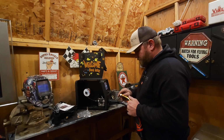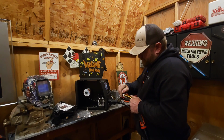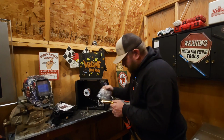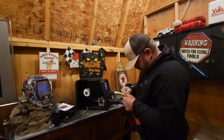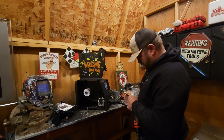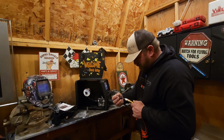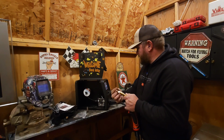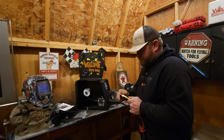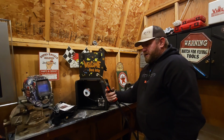Figure out which wrench it is. One thing I have to say, I'm gonna say it didn't look like the wrenches were real tight, but that was just me. Okay, this was the 035. So when you look through here for an 030, 030, okay. There's a spot in here for your tips and your wheels and all that stuff to go in. Okay, now our end's in here. Sometimes it can hit the back of there and stop it. So sometimes you just want to take that tip off, make sure everything goes together right. Okay, there you go. Set up, ready to weld.